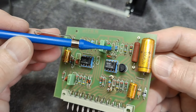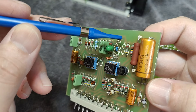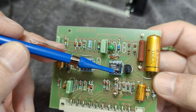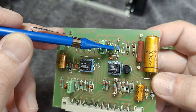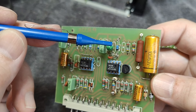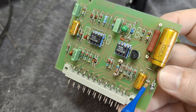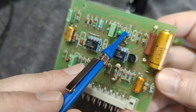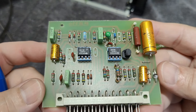Here's another cool thing. I'll go through the schematics a little bit later so you will see all the details. But this here is a Zener diode — the super reference — together with the op-amp, transistor, and all this, making up a parallel voltage regulator. This is 6.2 volts — the very expensive 1N825, a super good 6.2 volt Zener diode. And here is another 6.2 Zener diode that is not important, so they just use a super cheap Zener diode for that. They don't use the cheap Zener up here because it's the super reference, which reveals this is a very, very good and interesting product.